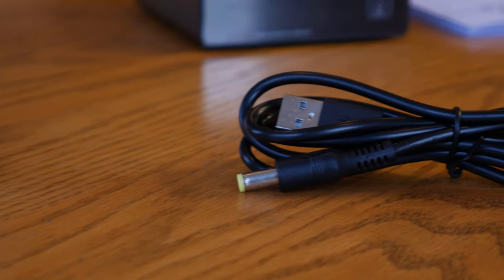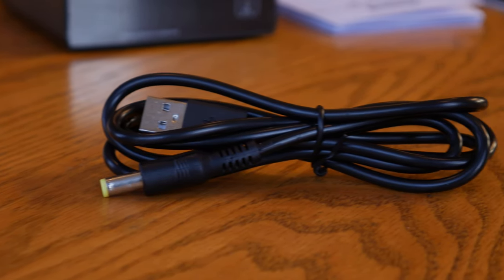One of the things that the E30 is really sensitive with is the power source. Unfortunately, I didn't have a proper linear power supply to power the E30 with for this review, but if you do decide to get one of these DACs for yourself, you need to make sure you power it properly. The DAC definitely didn't sound as good powered by my computer as it did with a high-quality switching USB phone charger, and I'm absolutely sure it would sound even better with a linear power supply — but either way, this thing was still very impressive, even without a great power source.